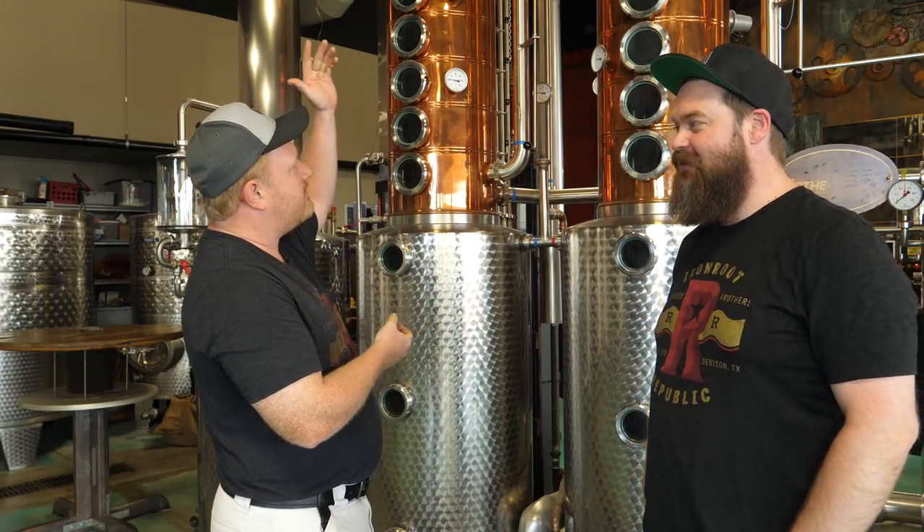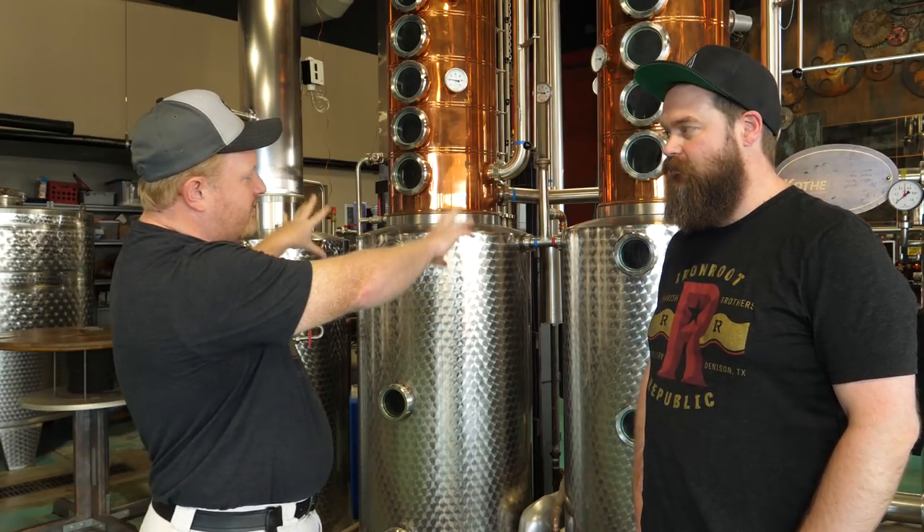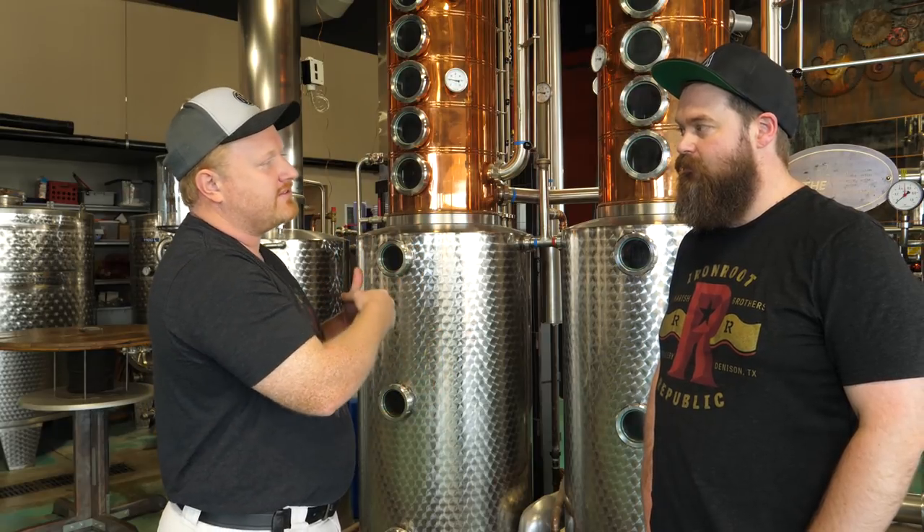This still is also kind of smart in the way it deals with water — I like to refer to her as a camel. She uses her water from the dephlegmators and from the condenser and stores it in the stainless steel tanks down here. Those store the hot water until after we're done distilling, and then a pump on the back pumps that into the cleaning system. So we're cleaning with hot water at the end — we don't need to heat the water to clean it. If we collect too much hot water it'll overflow to drain.